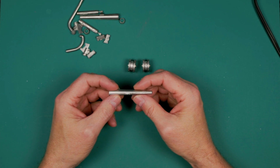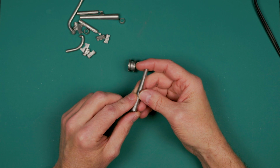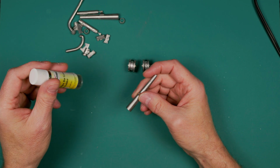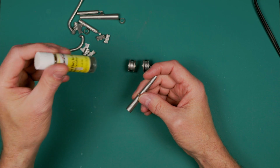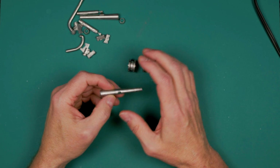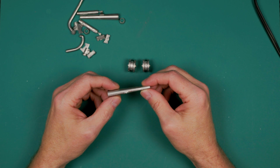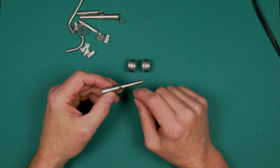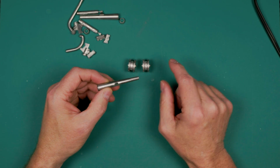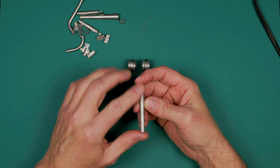Any metal oxidizes over time, so you have to remove that oxidation. That's part of what the acid core or the acid flux does. But the cleaner it is to begin with, the better, before you even get the flux on there. So that's your number one thing. Get the parts fitting together, clean them, and by that I mean clean, exposed, fresh metal.